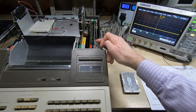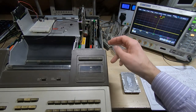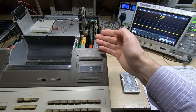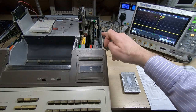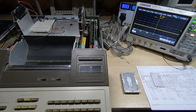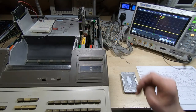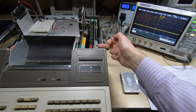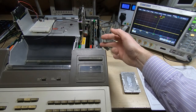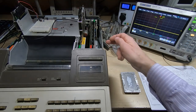In the previous video I had the analyzer attached to the LPU processor. There's a test connector along the top of the processor board. The boot-up sequence is fairly strange in that the two processors have to figure out which one is which. They look at the halt line going into the processor — it's not used as a halt line in the machine, just as the halt input to the CPU hybrid device. This machine uses two hybrid CPU devices, essentially a collection of custom chips on a substrate.